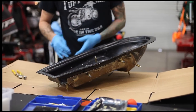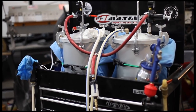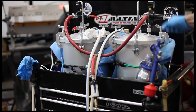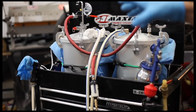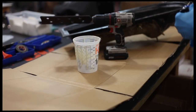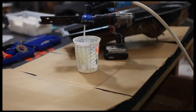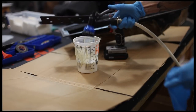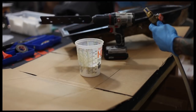This is really cool. What I ended up doing was creating this little two-part liquid foam dispensing machine. If you've ever tried using this stuff, you get a very limited time to mix it. One tank is part A, one tank is part B, and I can control the temperature because it needs to be at a certain temperature. When it's cold in the winter we can warm up these heating blankets to keep the foam at the right temperature so we get a good mix every time. Part A goes in — part A is really thick. You're okay until you mix part B — you only get about 20 seconds to do this, so if you don't mix it with a drill the chances of getting a good mix are pretty slim.